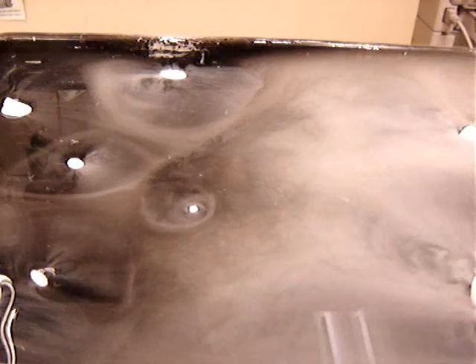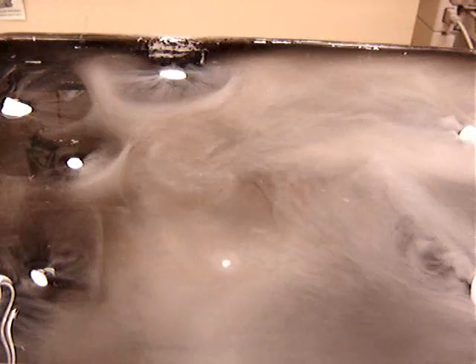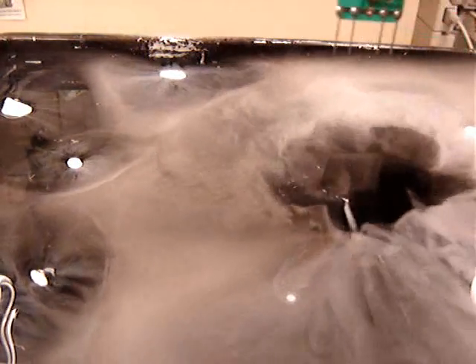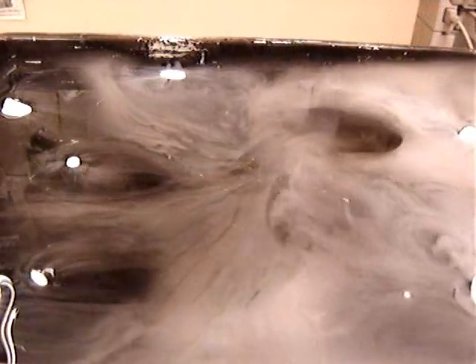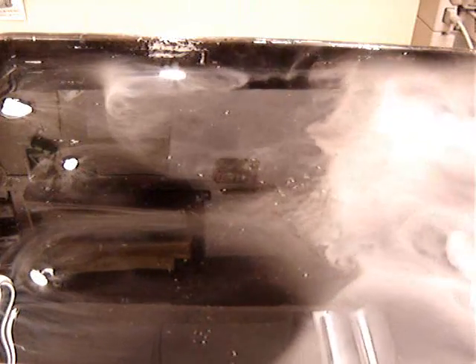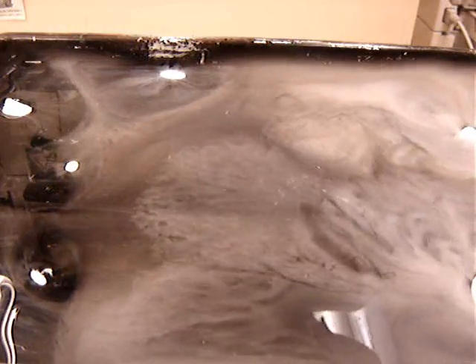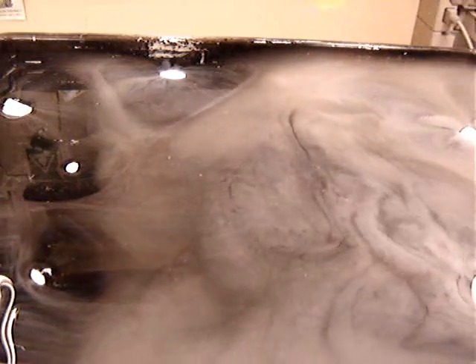Here are some sharp needles from the negative ion generator — they have a different effect. Blowing huge air flows, disrupting the fog layer. It appears that conductive metal shoots out fairly high current — microamps — whereas organic fibers are down in the nanoamps or maybe picoamps. But still, there's enough of an air flow or ion flow or whatever this is to punch little slots in the fog.